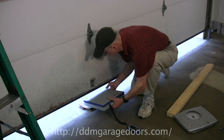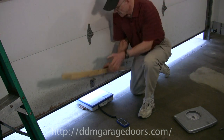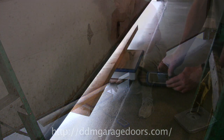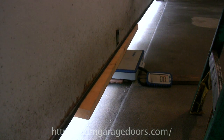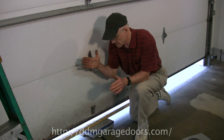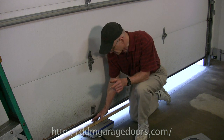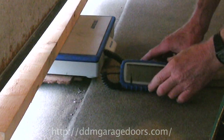We put the scale on top of the masonite. We also need a 2x4 to put over the scale for two reasons. One is to protect the door — a lot of the newer steel doors are made of very thin steel, and if you don't have a wide surface you can damage the door. The second reason is to distribute the weight; if you have a sharp edge on the scale, you won't get an accurate reading. So we've got the scale, the wood on top of the scale, the wood under it to give a flat surface, and then we turn the scale on.